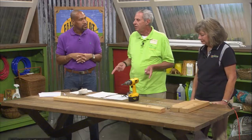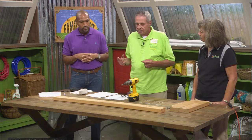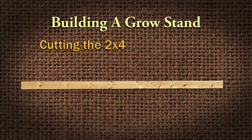Now, we're going to use an untreated 2x4. You don't want to bring anything treated in your house. The 2x4 by 8 foot only requires 2 cuts. The first cut is going to be 50 inches long, and that's where the fluorescent light is going to hang. It gives us an inch clearance on both sides of the 4 foot fluorescent light. Then the remaining piece, you cut straight in half, which is 46 inches, so it'll make 23 inches for each piece. If you buy it at the home improvement center, most of them will cut the wood for you. That's a good deal.